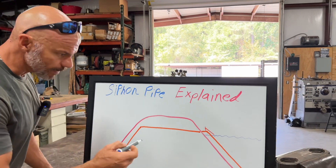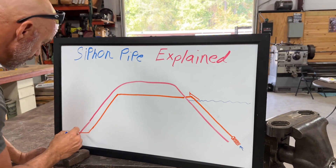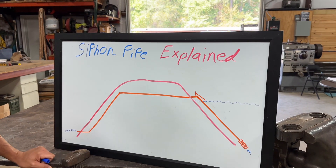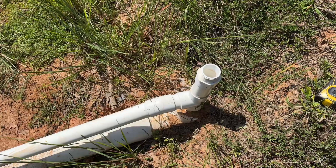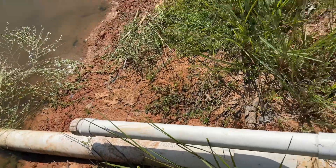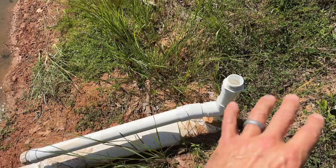So, your siphon pipe comes through the levee, through the water, and down to the bottom of the pond. Now, this end is on the other side of the levee, and all of it's covered up with dirt, and that's where it starts the siphon, and then it'll siphon out. Now, here's the little regulator. Here is the pond pull stage — it's right here. So that's the piece that goes in the water. Leave that cap off, plug this one, it sucks the pond down to that level. See how it's on an angle? That's how it works. You leave that cap off, plug this one, or vice versa. Plug them both, it'll suck the pond out.